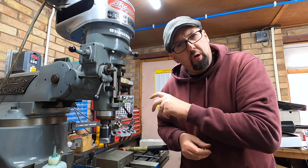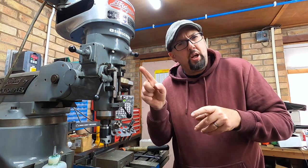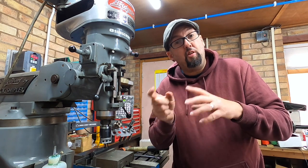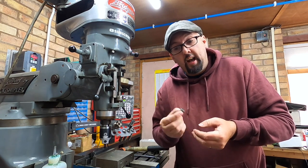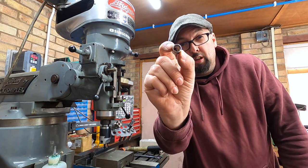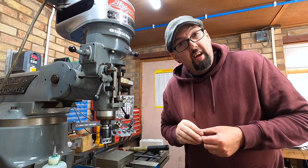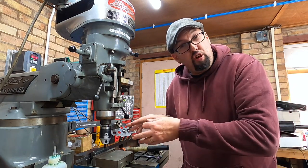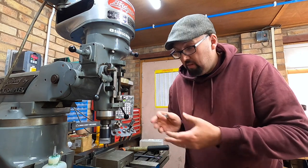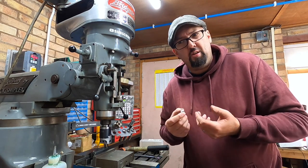So as it's slowly doing that, what are we doing? Well, this is the rear swing link on the banana piece on the steam engine, obviously. And I'm boring it out to push fit these little needle roller bearings inside. There's two here, tacked together — I'm doing it in one hit. Speeds it up.